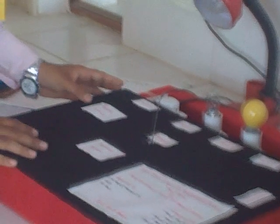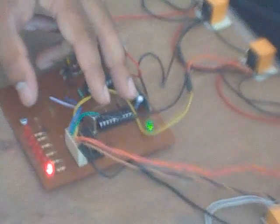This signal is modulated with a 33 kilohertz carrier frequency. This is the receiver section — this is the receiving antenna. The signal is received by the antenna and sent to the microcontroller. The microcontroller is the AT89C51. This microcontroller processes the received signal, and after decoding, the multiplexer sends it to the relay driver, which is named the ULN2003.